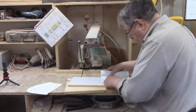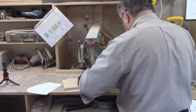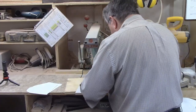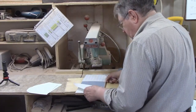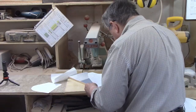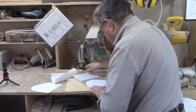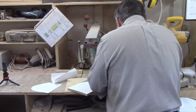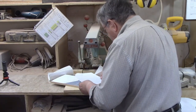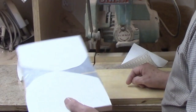There are several ways to attach patterns, and I'll leave a link to my video on nine different ways. My favorite method is with scroll saw tape, and that's what I'm going to use today. I'll leave a link to my source in the description. This is a double-sided tape that is semi-transparent. You roll it onto the wood, then trim it to width. For longer boards, you add tape until the board is covered. Then use your utility knife to pry up a corner and peel off the backing. Then you can apply your pattern to the tape, which holds the pattern securely while you're cutting but removes easily when you're done without leaving any sticky residue behind.